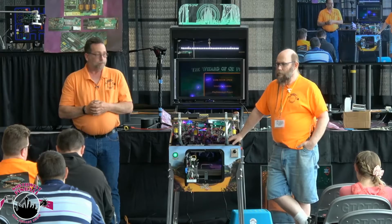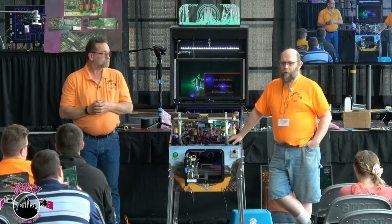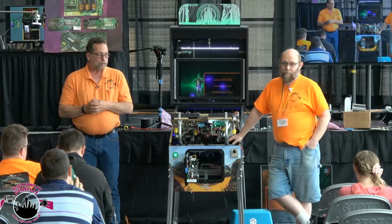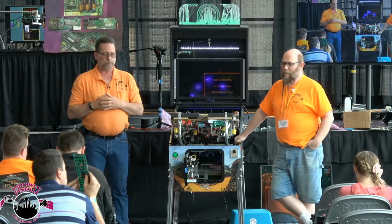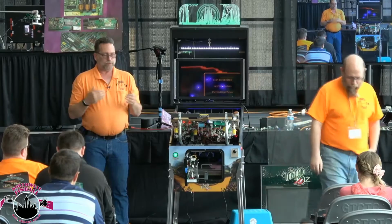I will not repair a board and let it leave my bench with batteries on it. Won't happen. I don't want to see it again. One of the biggest problems that we see with WPC boards is that the traces are so small, a lot of times when people remove the battery holders, even to install a remote battery holder, it will damage the traces enough that the board will not boot again.